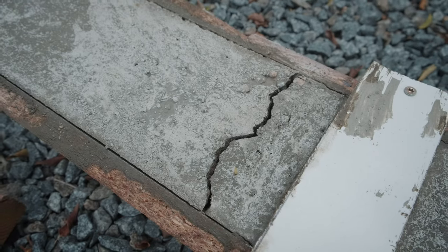Altogether I actually ended up with four parking blocks. I only did two pours but both times they broke right in the middle — the reason being that I didn't end up using rebar because I didn't have the right blade to cut it. It's in the budget but I just didn't have the right tool so I winged it and went without. It goes to show that anything over four or five feet is probably going to break. You can get small strips of rebar from Home Depot instead of the big long ones and just stick them in without cutting.